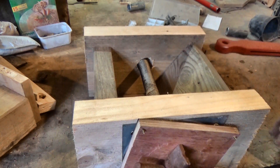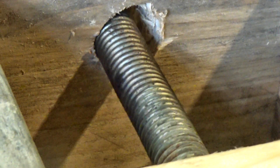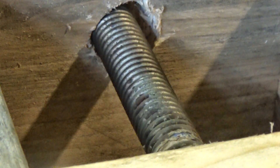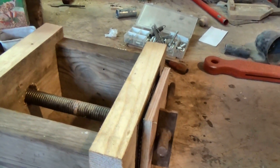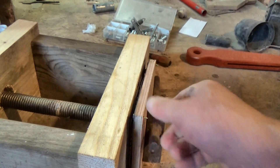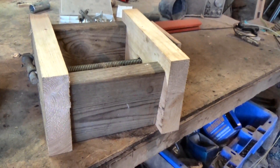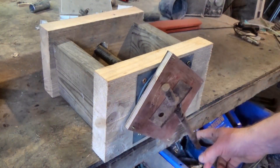That's my thinking anyway. So I made up this little experiment. In order to minimise the friction between the coils, I've pulled them apart a little before beginning — but that means lots of force involved already. So I've included a lazy Susan bearing on one end. This allows the spring to rotate while keeping the friction on the end plates to a minimum. The frame, even at this modest scale, needs to be fairly robust because we've jumped up a lot from the toy springs.